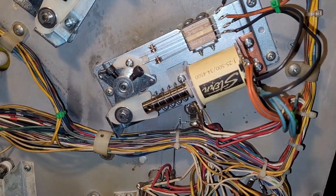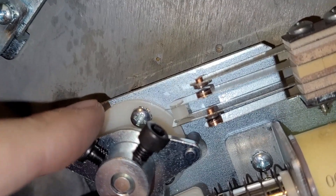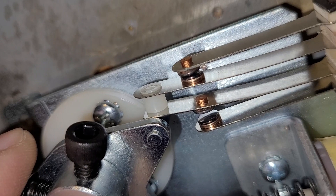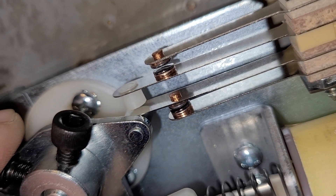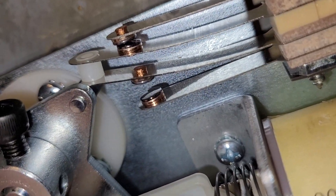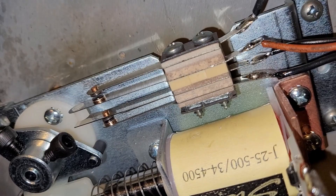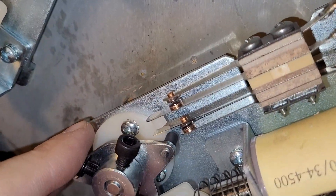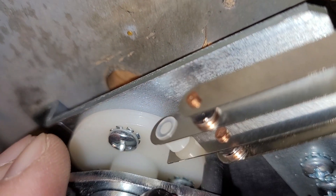Always so many adjustments with these flippers. This one is being a little funky and I figured out why — the switch blade is touching the crank, and then on the way down it's catching it and making a fun little noise. We can't have that. So I just got to loosen the switch stack and push it a little more towards the base plate. That should be better. Yeah, got a good amount of clearance there.